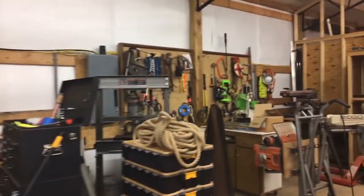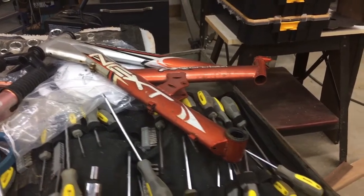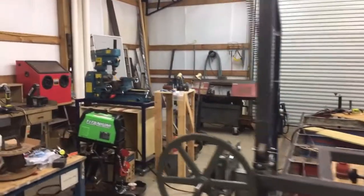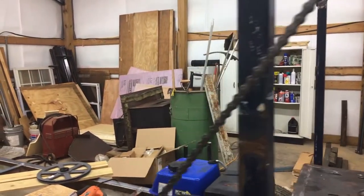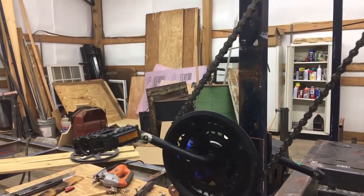Essentially, I bought an old mountain bike frame for $10 off of Facebook Marketplace, and this is it right here. I just cut out the hub area — the hub and the sprocket area — ground it down, and then took some tubing that I had where the tubing would match the inner diameter going in here, and welded it up. It works really cool — let me set this down and we'll take a look.